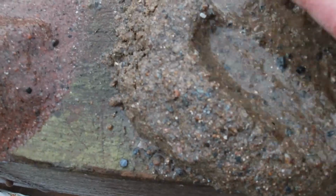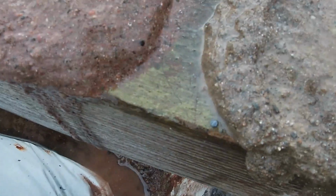I hope I've got something right with these guys, because it seems to be a big myth that most people think plastering sand needs to be fine and smooth, and that's how we get it smooth. That's all wrong, guys. That's how you go wrong. So that's a definite don't: don't use building sand for plastering. Use plastering sand. Plastering sand will stick to the wall better than the building sand.